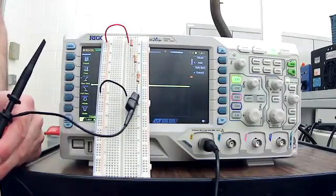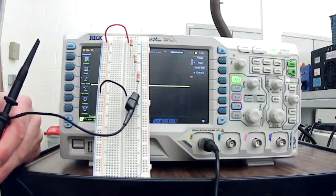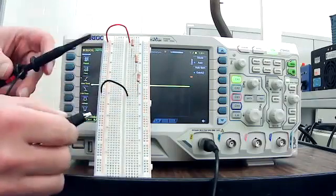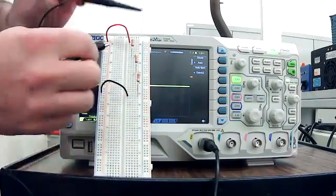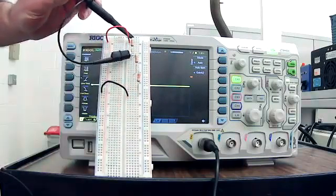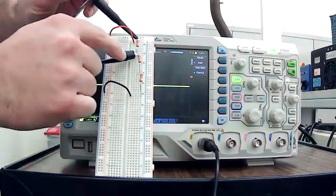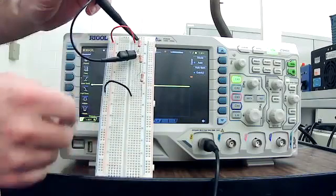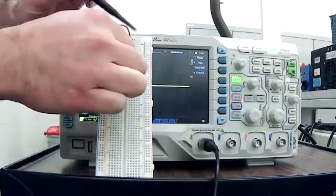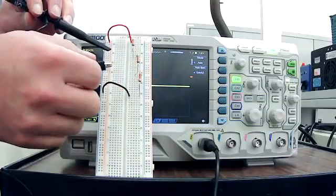So as you know, on the secondary side of a transformer, if you don't connect it to ground, it's floating. It really doesn't have a ground reference. So if this was AC and this is on the secondary side of a transformer, then could I put my meter here just over the first resistor? Yes, I could, because this wouldn't be shorting it to ground because my circuit is not connected to ground. So that's the difference. I could connect it anywhere I wanted, just as I can with my multimeter.